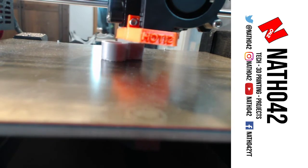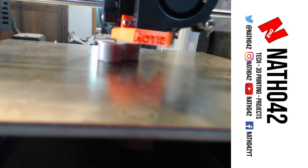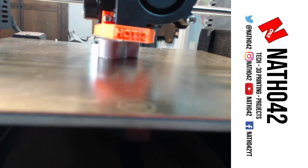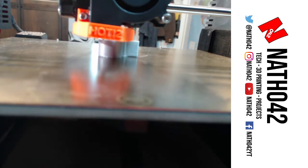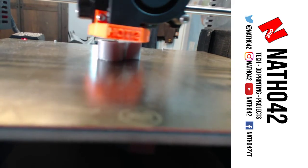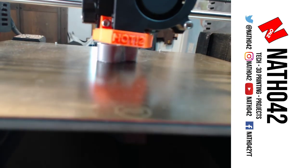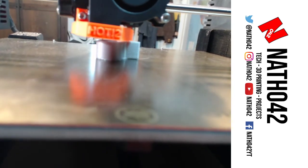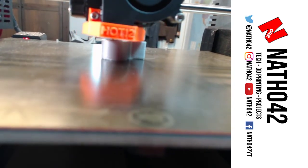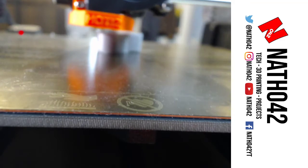There's a nozzle test, and it will check to make sure it's not too close to the bed. It does that test, and then you have the next test in which it will allow you to fine tune the distance between the print tip and the bed. And with that one, it works really well. You can just twist the nozzle to make it go lower, and it will print this massive print on the bed. And then once it's done, you have your bed set to the correct height, and you don't have to do anything else to get that set up.